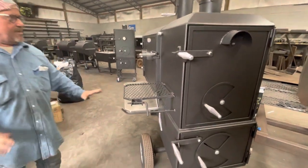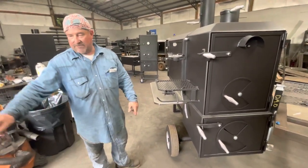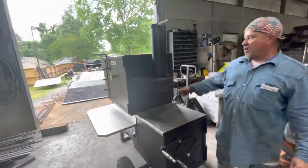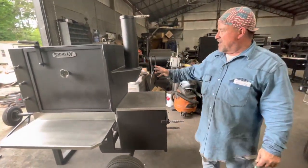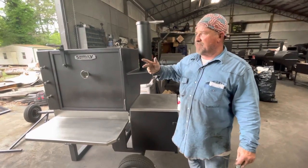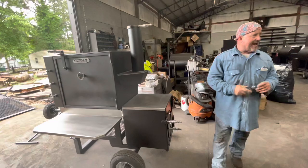It's really convenient because the door swings away from here. Like I said: 3,500-pound axle, half-inch firebox, quarter-inch chamber, hilt roofs on both chambers. So it's a short cooker — both of these are really short cookers, just with some different options. This 36 I made a really big collector box. Normally we put six-inch and four-inch stacks on 36s, but I elevated this one and made it a straight back — it's got more cubic inches. So I put a six-inch stack and made a big collector box with a drawer. This cooker's going to cook like an old god.